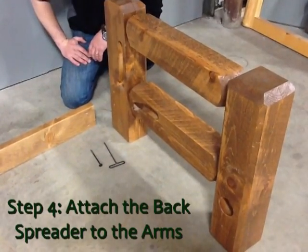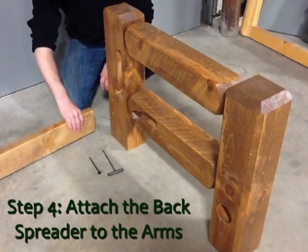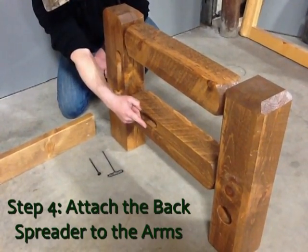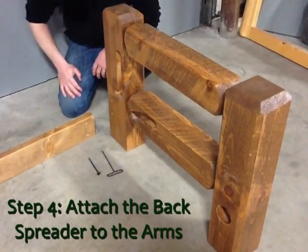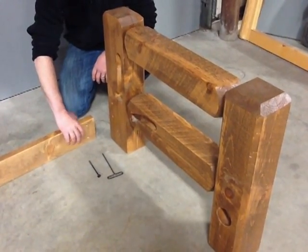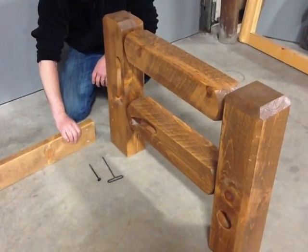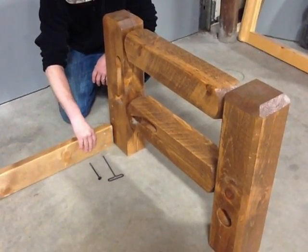After the four bolts we will now attach the back spreader to the back of the arms which are machined flat. The front of the arm has the round hole mortise in it. Carefully turn the flat back spreader up on edge so the rounded over edges are on the top and the barrel nuts are to the inside of the frame. Then lift the spreader and align it so the four bolts can easily go into the spreader.